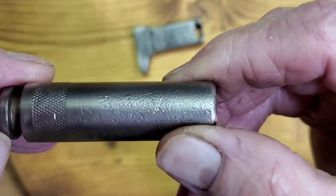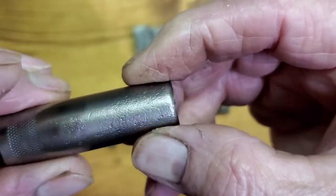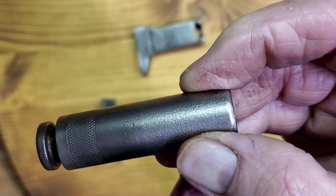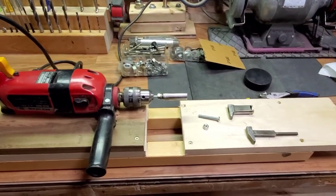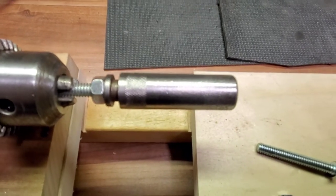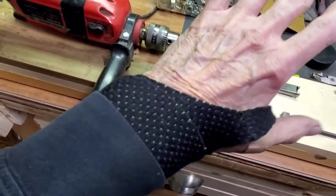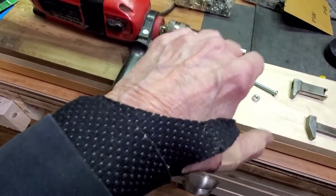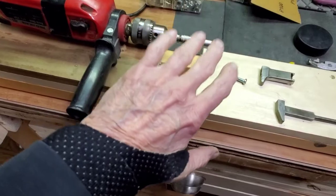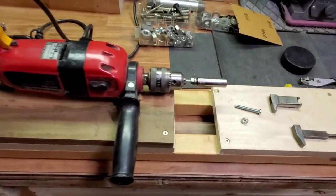The whole section here really needs it, except I want to keep the knurling which is nice. That's what a little wire brushing will do — it'll bring out exposed things that need to be handled a little bit differently. Continuing on with the restoration of the bicycle wrench, I needed to smooth out this part where there was a lot of fine pitting. I've got carpal tunnel or tendinitis from repetitive motion — a lot of hand sanding and hand filing — so I've got to back off on that for a while.